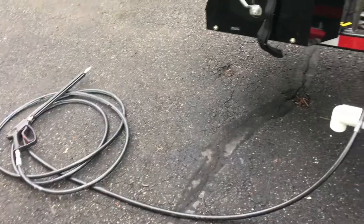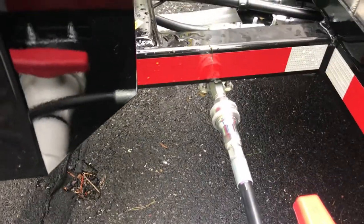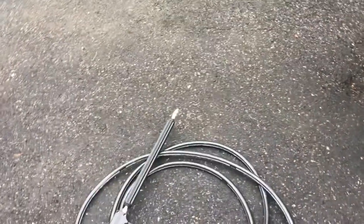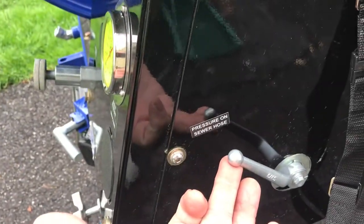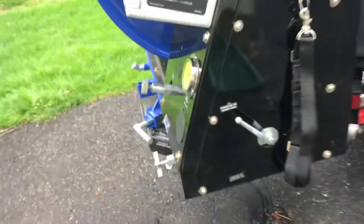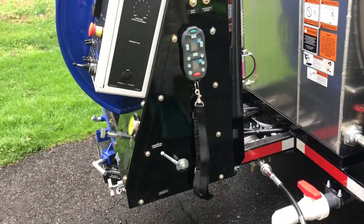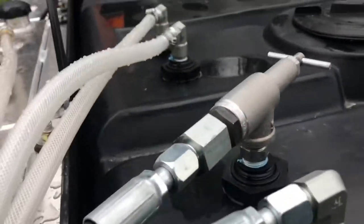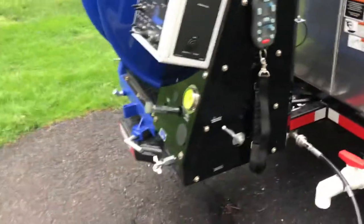There's a hose laying on the ground because this unit is equipped with a wash-down system. You can see the quick connect — this is 25 feet of hose with a wash-down gun. You simply switch from pressure on sewer hose to pressure on wash-down gun. When you're done jetting and you need to clean up a driveway, a manhole, or a pump down in a deep pit, this is a great wash-down system. It's built with its own PRV already installed and mounted on the tank, so you don't have to worry about overpressurizing.